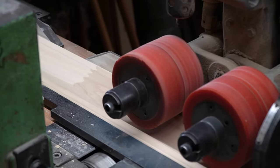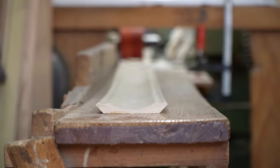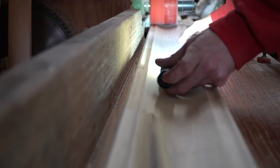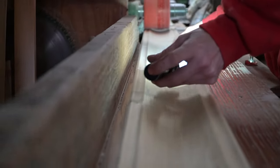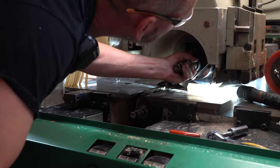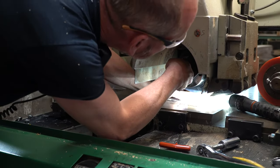Anywhere from 30 feet a minute to 80 feet a minute, you've got molding coming out of the back of your machine. SPLs run slower and our stock items are faster, probably 80 foot a minute. You get the flashlight out, shine it as it's coming out of the molder to see what those knife marks are looking like. We use calipers to make sure everything is really as close as we can get it within thousandths. Whether it be a piece of black walnut or whether it be a piece of poplar, it gets the same care and attention.